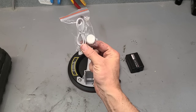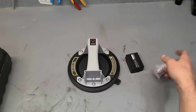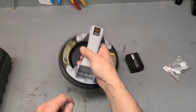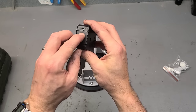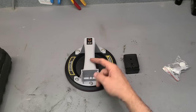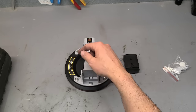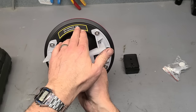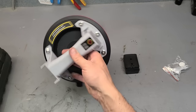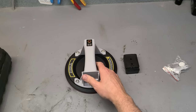That's what I find good about them. It comes with a little USB charger and a few spare filters that go underneath. The charger goes directly into the battery. This unit, on a smooth non-porous surface like a tile, can actually hold up to 600 pounds — but that's the maximum. The safe working load is about 375 pounds, so it's guaranteed to hold up to 375 pounds no problem.